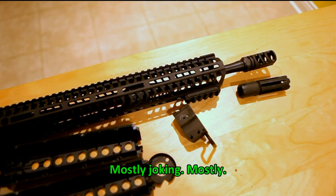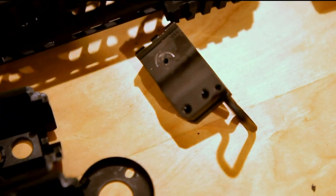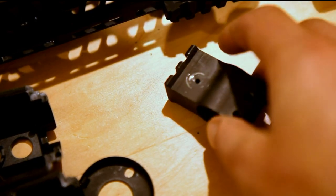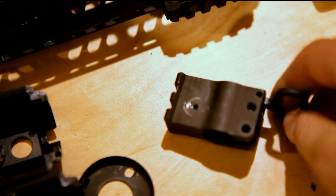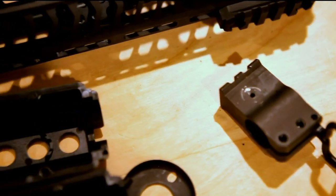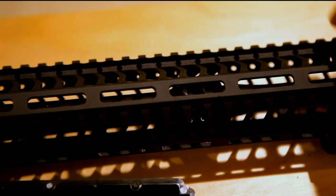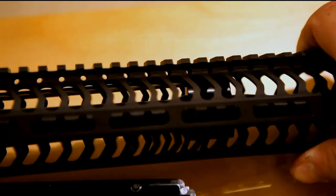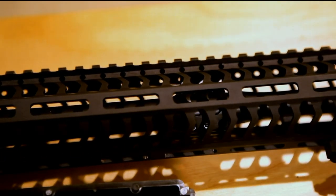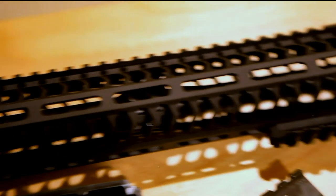When we get to the gas block, this is what you get from Smith & Wesson — this big hunk of steel, because it has the extra metal up top to get you to the correct height for a front sight and also the sling swivel. So this thing is like four ounces, and I replaced it with a Voitek low-profile adjustable gas block — that's the 0.750-diameter one. That weighs close to three ounces less, so right there you have three ounces compared to the factory gas block.